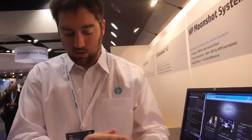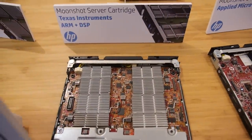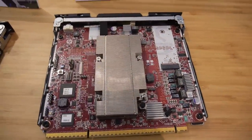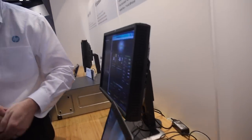We're running more on bare metal as opposed to doing virtualization. The idea is that when you have an overpowered CPU you have to slice it up with virtualization — you might as well just dedicate it. Instead, we have right-sized cartridges. Everything about these cartridges is right-sized: CPUs, number of cores, SOCs, network, I/O, and storage. That way you don't spend extra money on a box you don't need — no extra riser cards, no extra PCB space, no extra power and cooling.